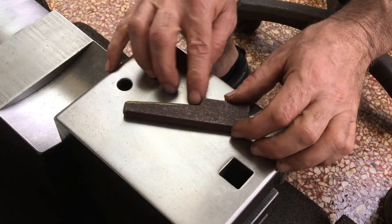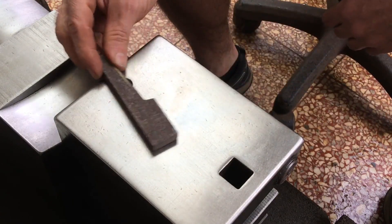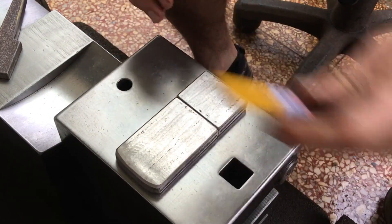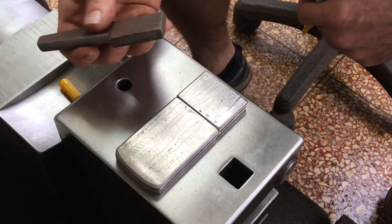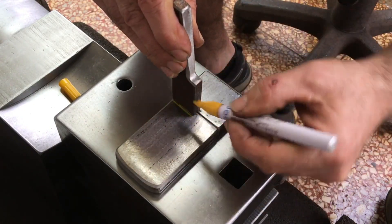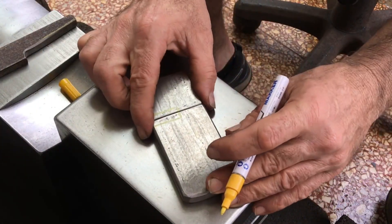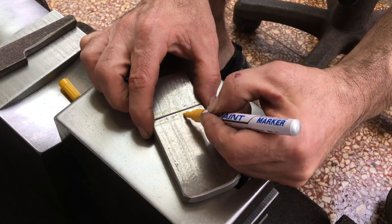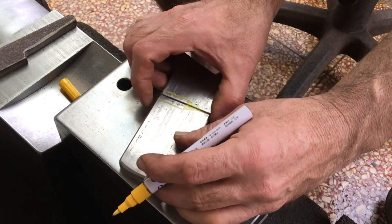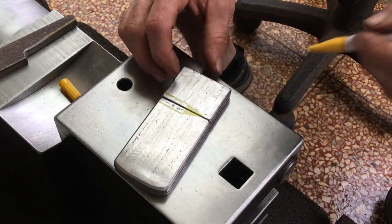I've got this piece of 1050 medium carbon steel and I've already cut a little bit out to form a tang. I'd like to use this piece to try out a set of dies — blade hollow bevel dies — that I'd like to revisit. This piece is pretty thick, 3/8 inch, so I reckon I need a recess on at least half of the die set and a bellied taper on each die in front of that recess. Since I don't have precision tools for stock removal or grinding, if I can hammer something close to final shape I can reduce the amount of grinding needed and do away with those precision tools.